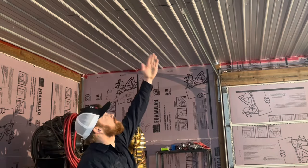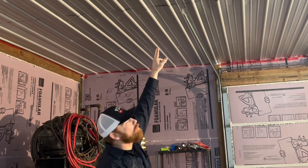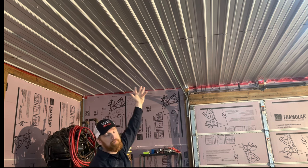If you notice in the video there are two-by-fours coming down that went to the garage door tracks — we completely eliminated those. We marked on our steel ceiling sheet metal where the studs are, and we're going to take an angle iron and screw it right to the studs. That makes a cleaner look — no hole going through, and no more two-by-four hanging down.